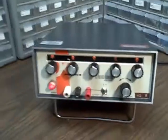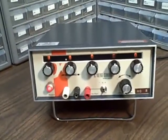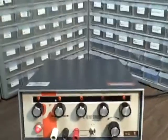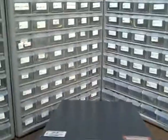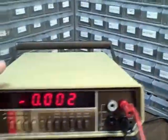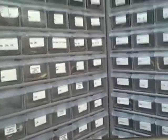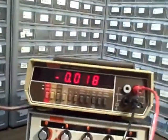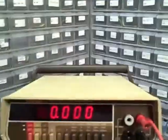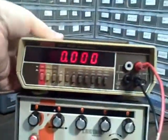We're going to put it through its paces here and verify that it is indeed accurate. I have verified it against my Fluke 343A and I'm satisfied. I will then also verify it using a calibrated 4.5-digit meter, the Keithley 179A. It has a nice bright readout so it'll be easy to see the response. Let's get the cords and connections out of the way and check our zero.